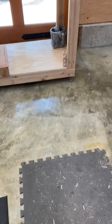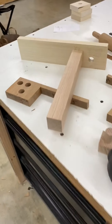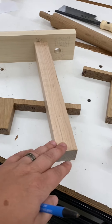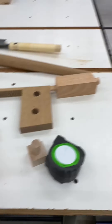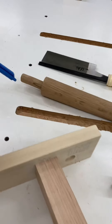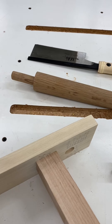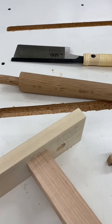I've got a whole stack of practice pieces down there, but the joinery wasn't working out well. I fortunately stuck with it enough to figure it out. Unfortunately, I took off enough length practicing on the tenons that I didn't like it, so now I'm going to do loose tenons so I don't have to shorten the table more than I'd like.